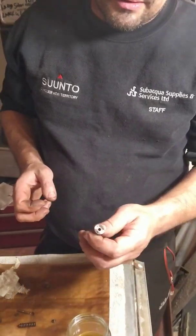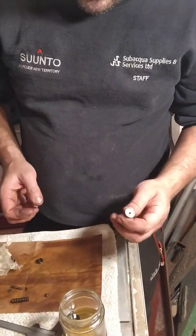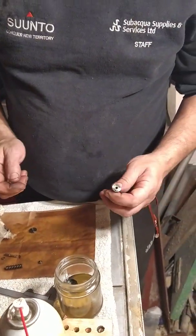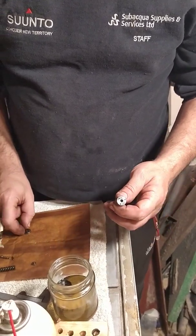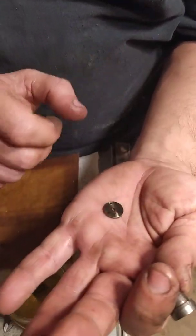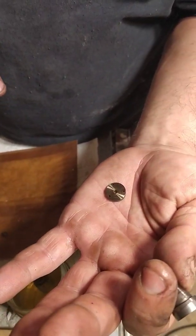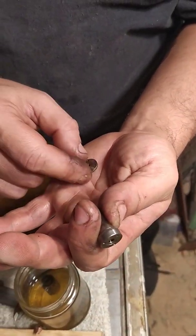I prefer to clean the parts with toluene as suggested on several websites. They also mentioned that toluene can be heated up, obviously be safe. I just cleaned the parts, the important parts, the nozzle and the stop plate, and I've inspected them, and it seems that no scratches are present, which is a good thing. No scratches means that they are going to seat perfectly and make a tight seal.